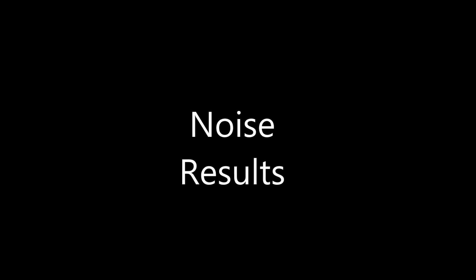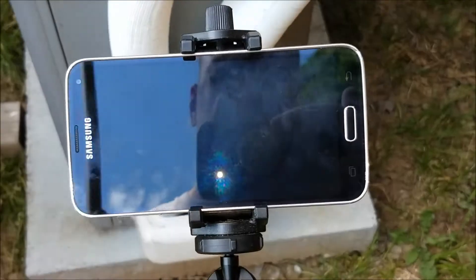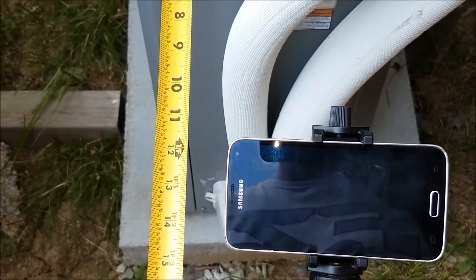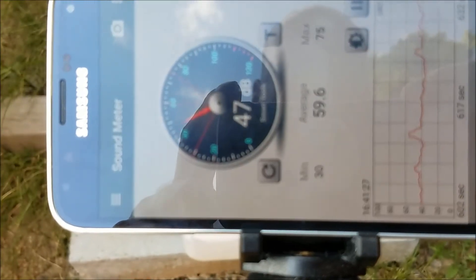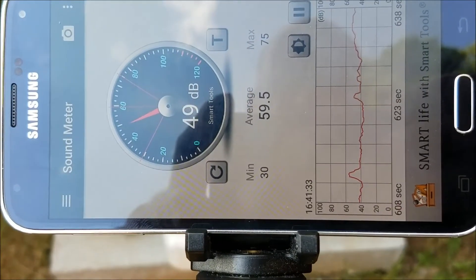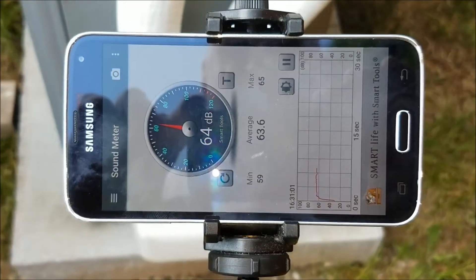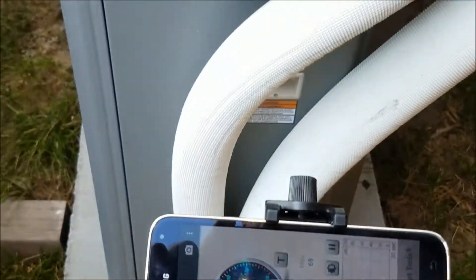Here are my noise results from the unit. That second bolt on the left is where the drill bit walked, but other than that, here's our meter — a sound level app on the phone — measured about 12 inches away from the outdoor unit. Ambient noise is right around 45 to 48 dB with nothing on, just crickets and wind. Once the outdoor unit kicks on, it goes up to about 64 to 65 dB in steady state. When the inverter ramps up or turns off, you'll hear it go a bit higher.